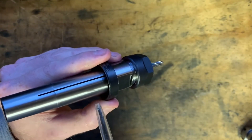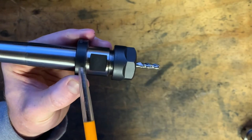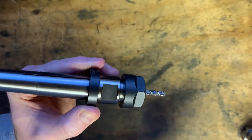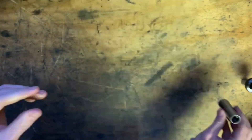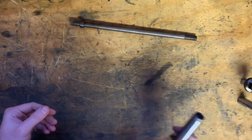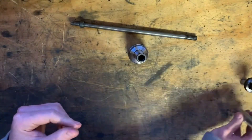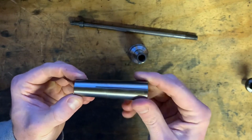When the collet is hard up against the spindle nose, the distance from the tip of the cutting tool to here does not change. Now, for me to be able to utilize this I need to make myself a new drawbar — that's what we'll be doing today, as my half-inch BSW drawbar only fits the ER32 collet chuck and I need a 3/8 by 16 TPI thread to draw this up into the mill.